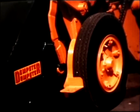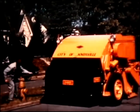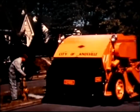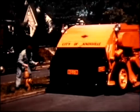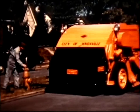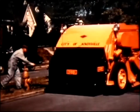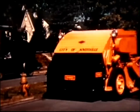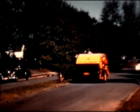Note that on contact with hopper lifting pins, the hydraulically operated arms are ready to hoist hopper. Now, let's see the Elgin 81D in operation. First, a good operator always flushes out the hydrant before filling the Elgin's 170-gallon capacity water tank. With the hose back on the convenient rack provided on the sweeper, operator is ready to sweep the streets.